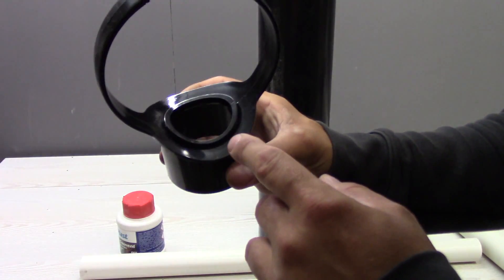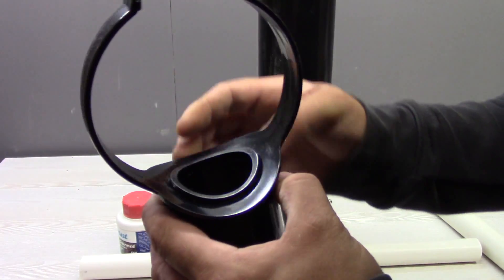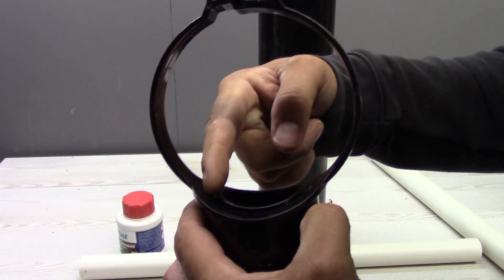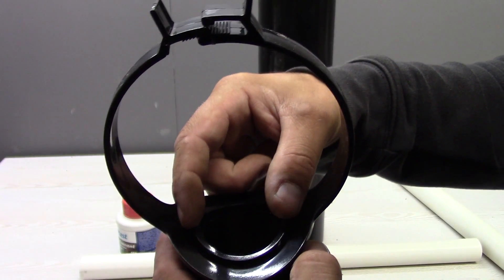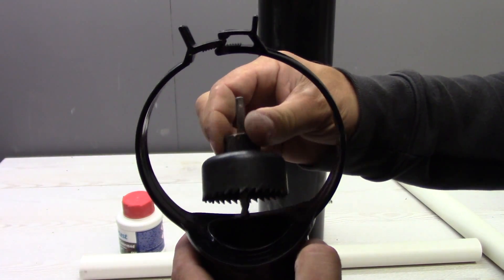As you see, the BOSS strap adapter has got a little ring here that should go into this pipe — just this bit. So I need to cut a hole exactly like this. I measure this is 54 mm, so I'm gonna use the hole saw 54 mm.